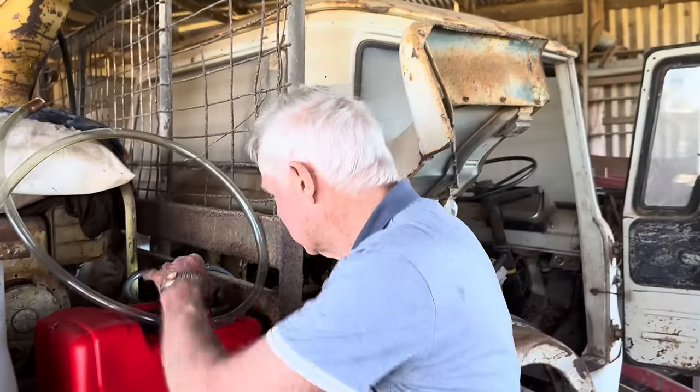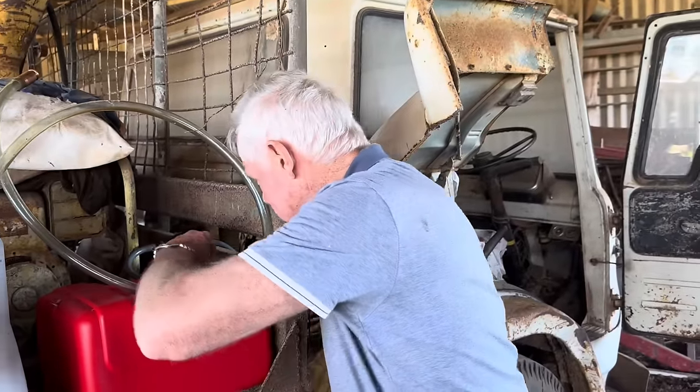We just had a vacuum lock in our outboard tank — so maybe that's why she only ran for so long before she shut down. Just had to loosen the cap off a bit. It's actually got a little bleeder in the center of the cap. I forgot to undo that. We may have to bleed the pump again, but it was all my fault — I should have undone the little air valve on the center of the outboard cap, just forgot about it.